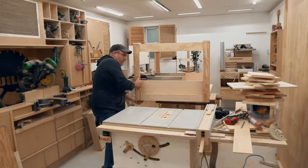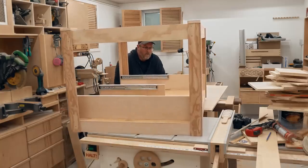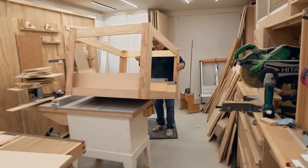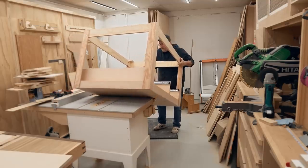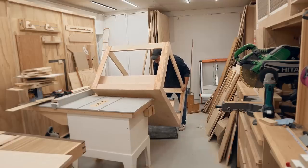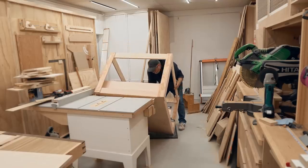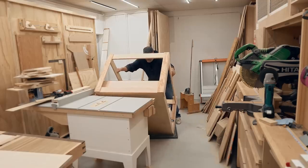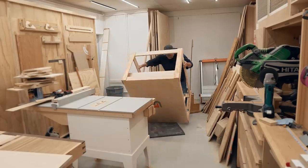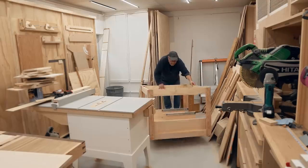With all that done I can move it down to the floor. Being a one-man operation, you have to figure out ways to do this without breaking your back. The problem with the torsion box wanting to stay really flat is that if the floor itself is not flat, there's a good chance only three of the wheels will be sitting on the floor at one time, and the other one will be up off the floor making it tippy. To solve that I'm going to build a mechanism that lets those back wheels move independently of the frame — kind of like a seesaw.